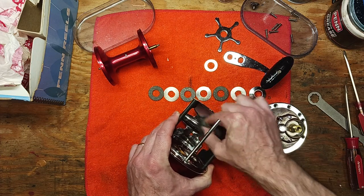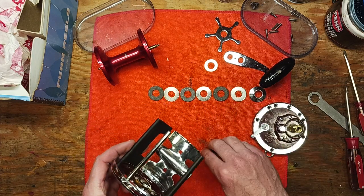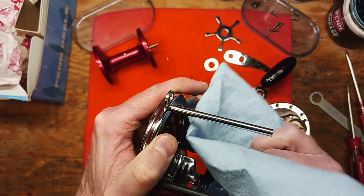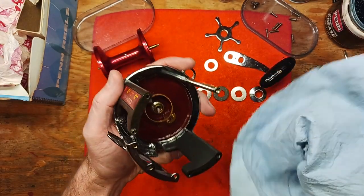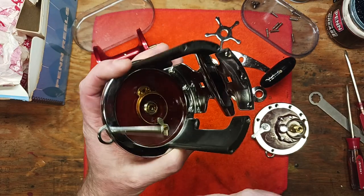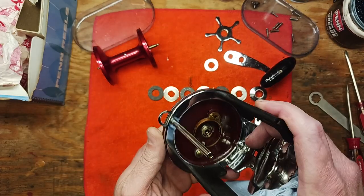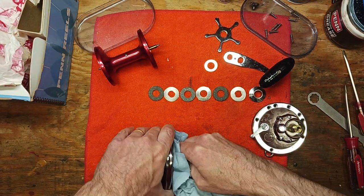There really is no corrosion on this reel whatsoever — just a little bit of fogging from sitting on somebody's shelf for so long. I found this reel on eBay at a reasonably decent price given how rare this particular model is. If you're dealing with a reel that has more signs of rust, damage, pitting, and corrosion, then you'd go to the extent of taking apart the whole side plate. But here you really just need to free up the ball bearing and make sure the threads are intact.